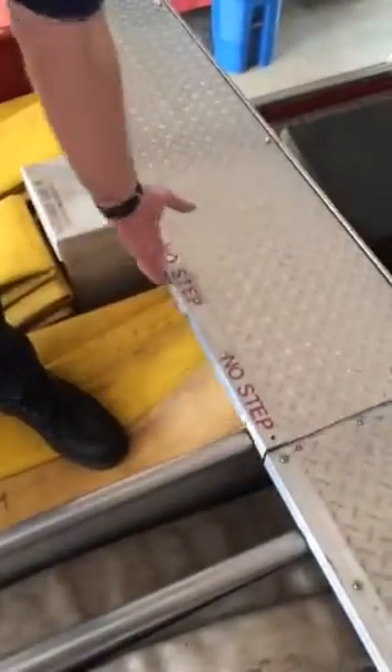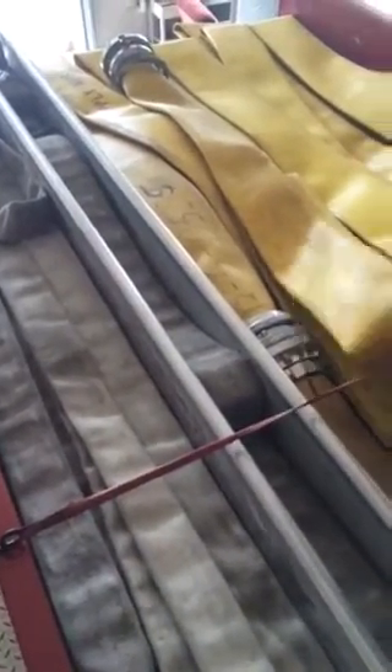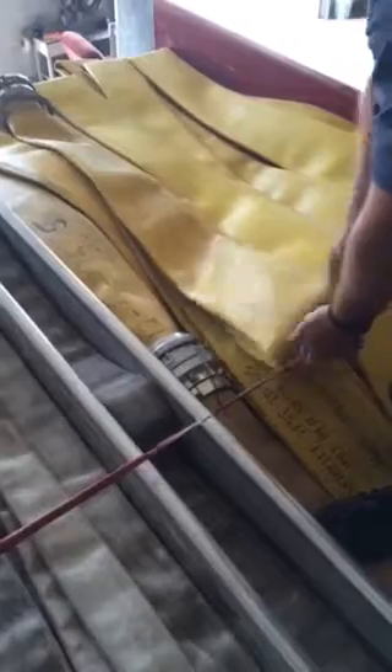Here on this particular rig, if you look right up here, we have what's called a draft step. The draft step shields the ends of the hose and prevents wind from getting underneath and flipping it up out of the hose bed. Here at the midpoint, we have just a simple ratchet strap that we put across here to help contain the hose, keep it collared, and keep it here in the hose bed. But if you look right here, both on the static bed with our 5-inch supply line and our 2.5 static bed, we do have issues of these odd loops. And here even on the pre-connect, these odd loops — if you're going fast into the wind, you have the potential for the air to get underneath and flip it out of the hose bed.